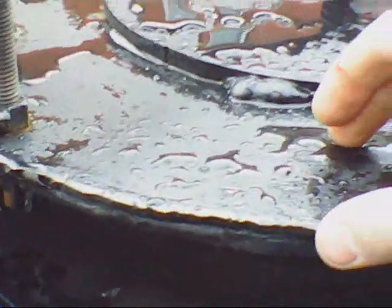I got frustrated, so I made my own lid. It's a couple pieces of plate with a gasket - it's called 'The Right Stuff,' an automotive high-heat silicone gasket. I put it on one side, let it tack up a bit, greased the upper lid, then put it together and left it for a day. That makes a really solid gasket on the bottom flange that doesn't stick to the top. These flanges are about four inches wide, and I did that on purpose because the wider the flange, the less chance of gas escaping.